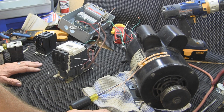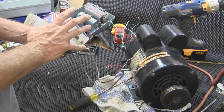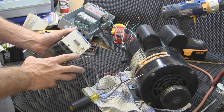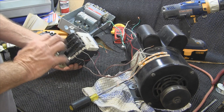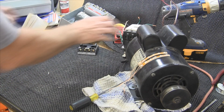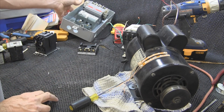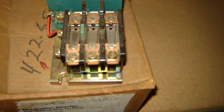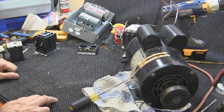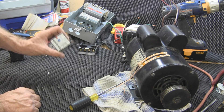The ability to go through this yard with all this equipment in it means I'll be able to take different contactors apart and show you how to change out the overloads in them. Like this one here has an electronic overload, and then this one here has thermal overloads — it's more of a mechanical type. And then there are different types, like this one is electronic.